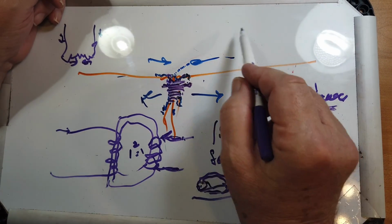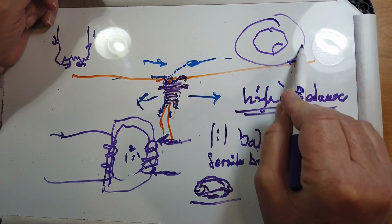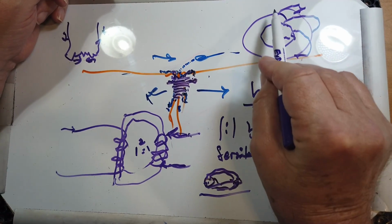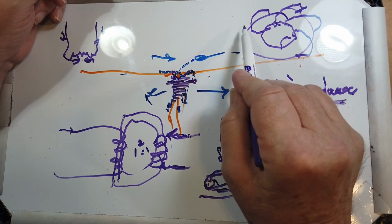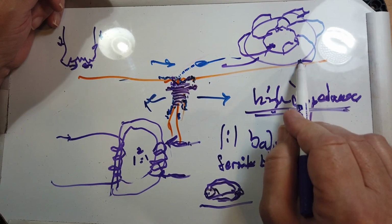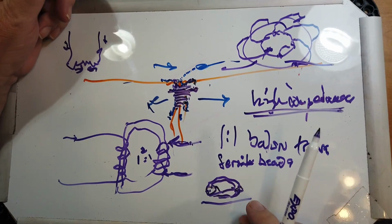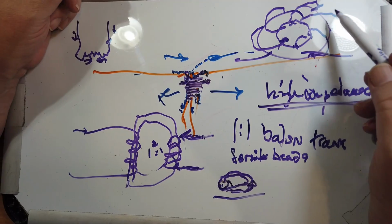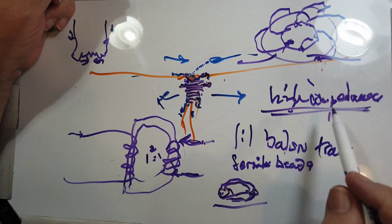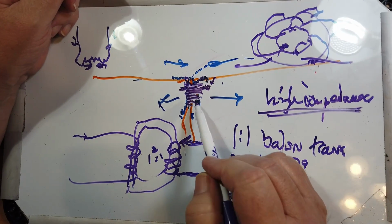The other thing that you can do is take a fairly large toroid and wind your coax through it like this several times. The direction doesn't matter. So you have one coming out here and one coming out here. That will also work as well. Now, the problem is that each turn in the ferrite attenuates the incoming signal a little bit, but not completely, and that's why it takes so many of them.